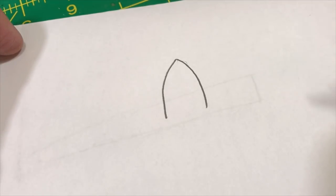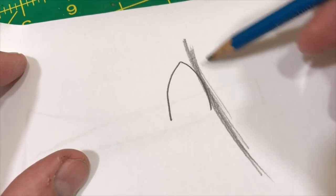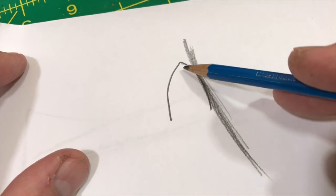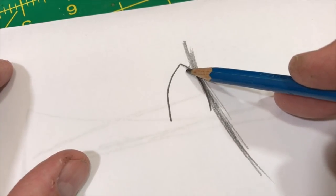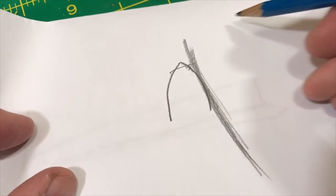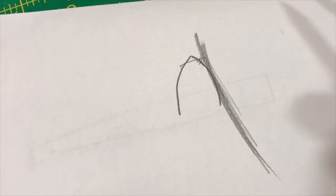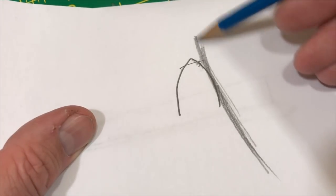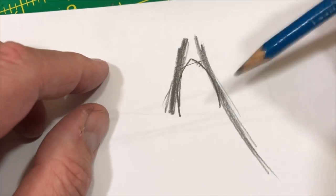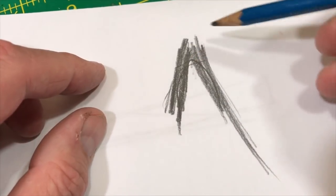when I was looking at it, I could tell from this profile that my first attempts, my angle was going to come in something like this. So I was going to have this flat, and then have this space here. This was going to stay. And I looped this, and it was all full of micro pitting and rust. There were holes you could see right through. It was bad. The razor was abused and not stored correctly, and it was never honed correctly. I think it was free-handed because there wasn't a lot of wear up on the spine. But I could tell by looking at it that I was going to wind up with this type of thing here, and I would have to hone both sides. And then what you wind up doing is you keep doing that, and eventually you wind up with this new profile. Just wearing.